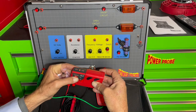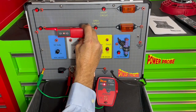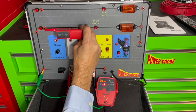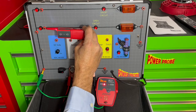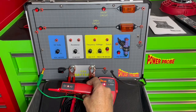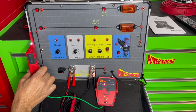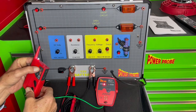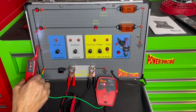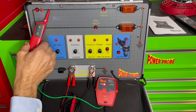We'll take the receiver and turn it on. Using the green wire, notice now the signal is the center dot — that's the open circuit signal. There's no directional capability for open tracing unfortunately. Lock it in and give it a little more sensitivity. At some point you can go to here and it's going to go across that switch and go open.